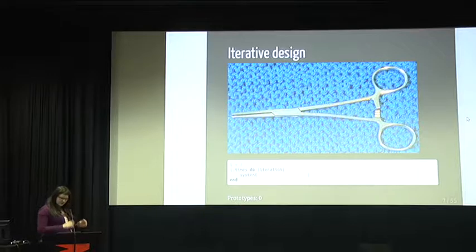Also, this thing is made out of steel, so I needed to change the material properties. It's quite thin — look at the arms, they are maybe a few millimeters thick. If you make the same thing out of plastic, it will just bend or snap and not apply any force to the actual tool head.